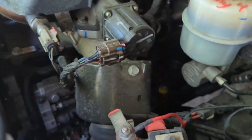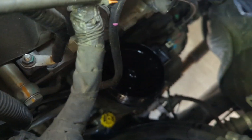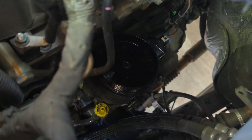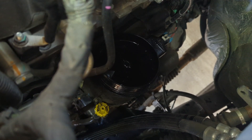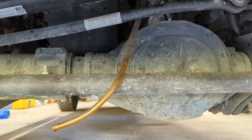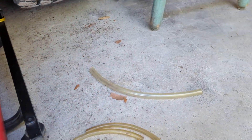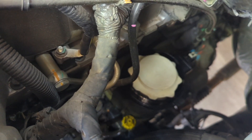The paper goes in right there inside that yellow tab, to the right of the yellow tab. That yellow tab is just a valve that opens and closes to let your fuel out so you can change the paper filter. You hook a hose onto the end of that yellow valve — the tab — run it down to a catch pan. Mine broke off; I had to put another piece of hose on. Luckily I have a bunch of extra. Let it drain.